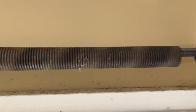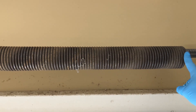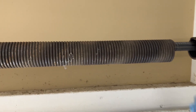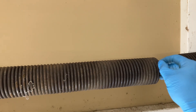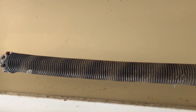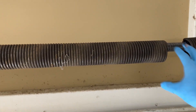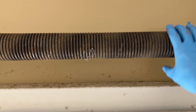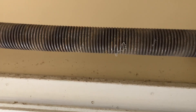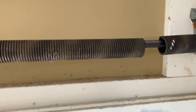From my research, coil wire diameters can range anywhere from 207 thousandths all the way up to maybe 295 thousandths. I just wanted to do a direct replacement, but there are charts out there that go off the garage door weight, the length, and what type of tension spring you actually need. You could call a garage door company and they'd be able to tell you, but if you're just doing a direct replacement, that's how you measure it.